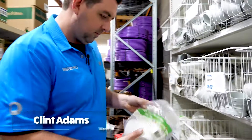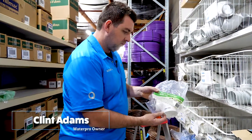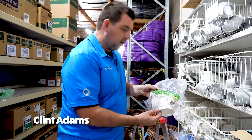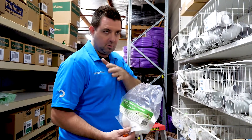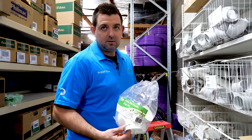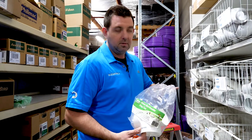This is a new product that we've just added to our stock — it's a 90mm stormwater snap tee. There are certain times where you want to put a grate into an area or tee in some stormwater, and if you're cutting into an existing pipe it's a real pain. You'd need to use a telescopic coupling and dig back further.